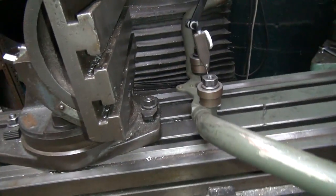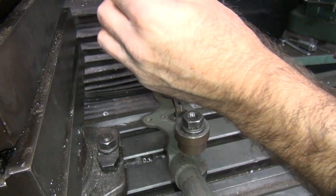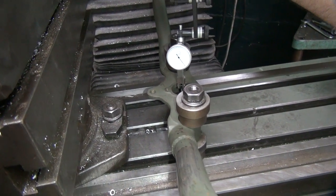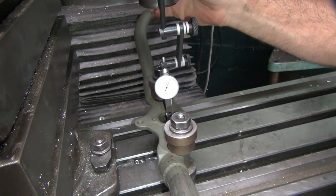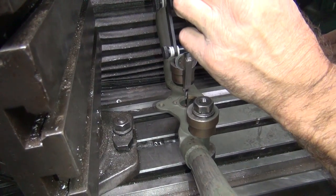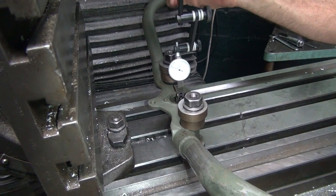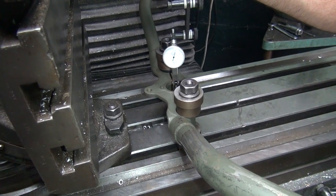Okay, so let's come back and redo our center. We were close before, so we just move it until we hit. Even now, see, it's three that way and it's 13. It's 10 thou difference this time. It's more than that before. This one we're not even touching. Okay, the high spot is zero. So high spot zero, you split the difference. Same, but close.